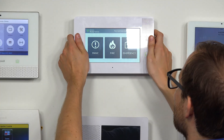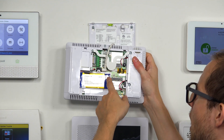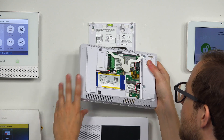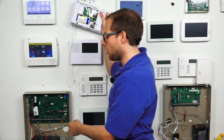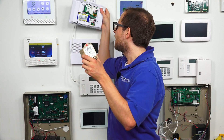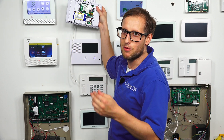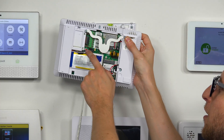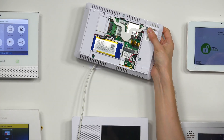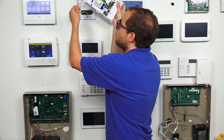And that order is battery first and then transformer AC power second. So let's cut power to the system — let's open it up. And you can see it came easily off the wall mount there. We have a Honeywell LT cable in this case, so I can cut AC power by unplugging this connection right here, and you're going to see the system is still on its battery backup, although it does say power lost. If you didn't have a Honeywell LT cable, what you could do is unplug the transformer. It can be something like this, although it can vary between different systems. But you would just unplug that from the wall. If it has a screw in it, you would need to undo the screw. Or if you have a hard time accessing the transformer, you can also cut power at the circuit breaker. Just cut AC power. If you have yours wired into the terminals, don't undo the terminal connections — that's kind of a no-no. Stick to either the circuit breaker or unplugging the transformer. Or if you have a barrel connector, like we did with this, then that works as well.